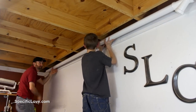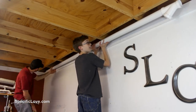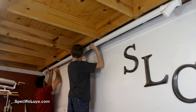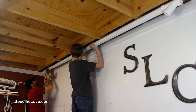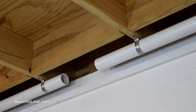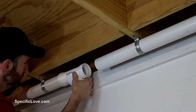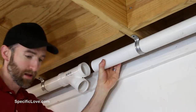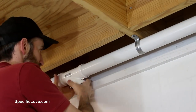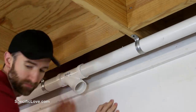If you have a little workshop at your house, there's a good chance you have a bunch of dust everywhere. It's not good to breathe that dust or have it get into everything, so it's a good idea to create some kind of dust collection system. I've done that in my shop using some two-inch PVC pipe and fittings connected overhead, with some additional hosing connecting it to my vacuum.